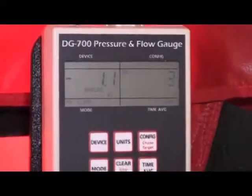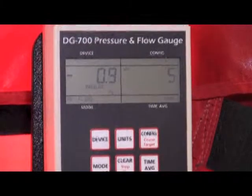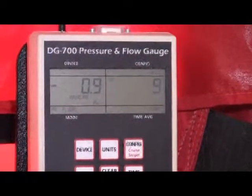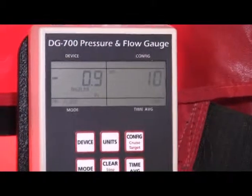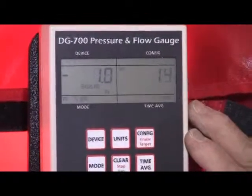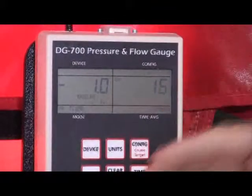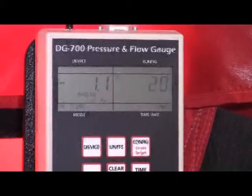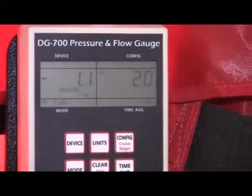So over here it'll record one second, two seconds, three seconds. Given the fact that I've got a little bit of wind on a winter day and it's warm inside, I'm going to give it 30 seconds or so just to build up some baseline data. Then the computer in this manometer will be able to calculate from that baseline an exact 50 pascal difference between inside and out. So we'll give it another 10 seconds here.